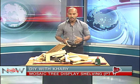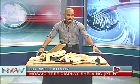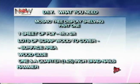So what you will need is a piece of ply that is cut 4 feet wide by 2 feet in depth, all right? And then you need a whole lot of scrap wood to cover the surface area of that ply. You're going to need some wood glue, and then some 1.25" brad nails, followed by a hammer, of course, to get those brad nails in.